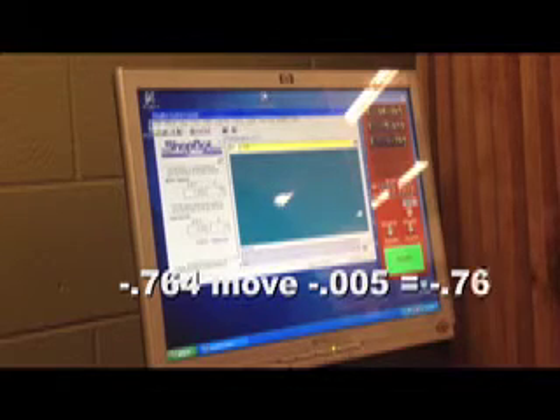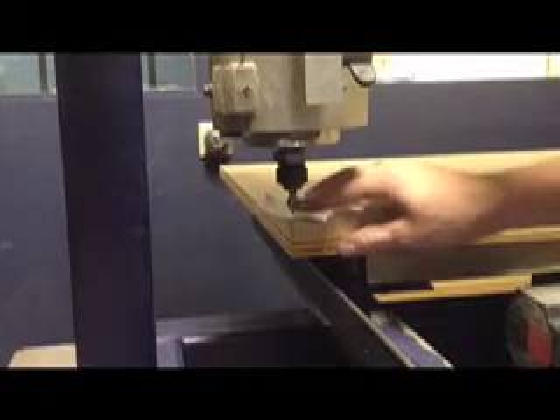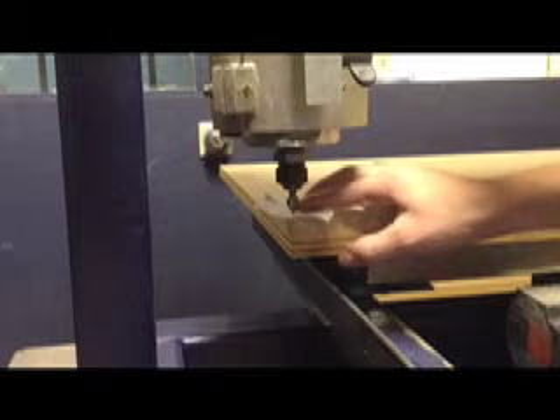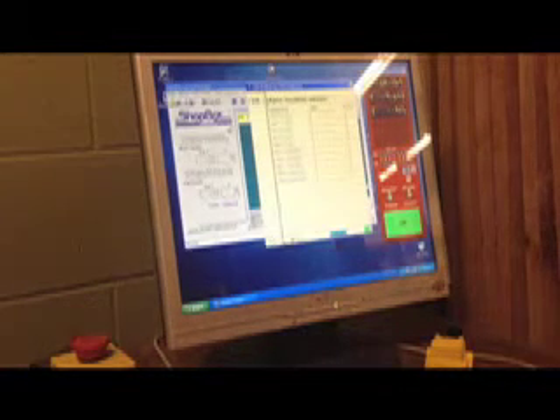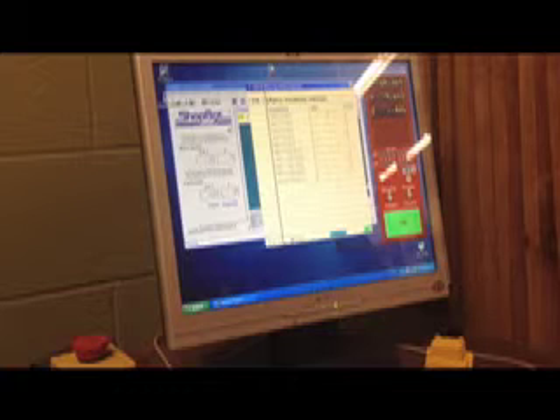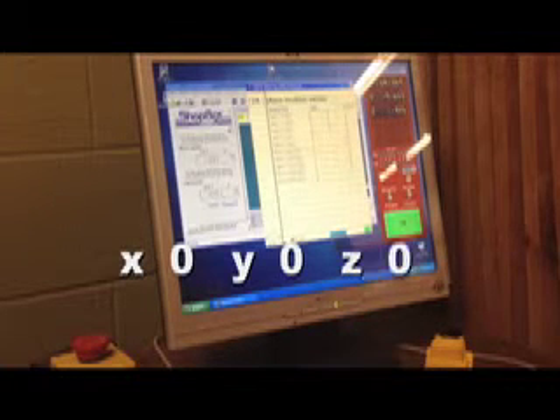As you can see, there's just enough pressure on the cutter on top of the paper to hold it in place. Next, double-click on your coordinate and enter zero for all axes. This establishes the zero location for all of your axes.